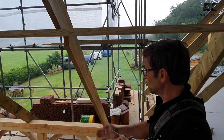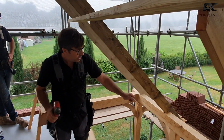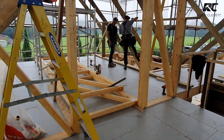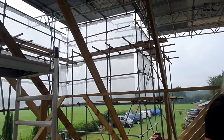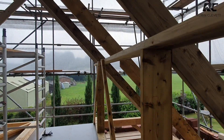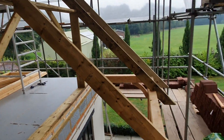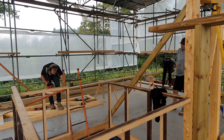That's how I set my head plate of my ashlars — nice and tight — then we'll fill it all in by dropping studs in. If you tried to build the wall first and your wall plate has a tiny hump in the middle, it would lift your rafters up, whereas this way they stay nice and true. The guys are putting in intermediate studs, going underneath each of the setting-out rafters, and it's going to be absolutely spot-on. It's all done from the measure — we hardly level anything because the geometry is always perfect. Once that ashlar is in, it eliminates any of the oak pushing or moving because of the loads coming through the roof.